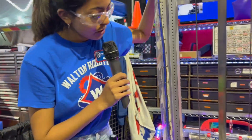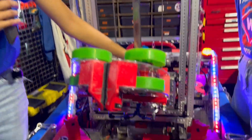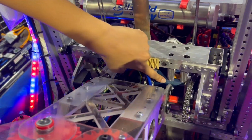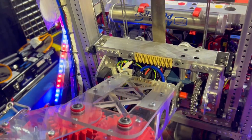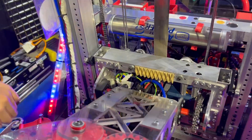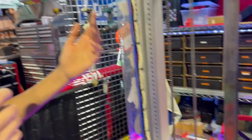In the carriage, we've got a wrist. There's a Neo motor with a Sport gearbox — it's a little hidden behind the wires. Two sprockets allow the wrist to rotate. We've got soft limits that prevent it from going too far up or down. We've also got encoders on the wrist as well as on the elevator pivot, which assists the programming and lets them know where to set set-points.